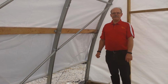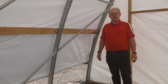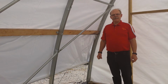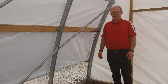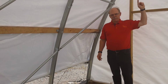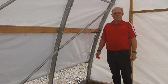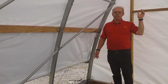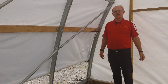Once the warm season is there consistently, then it would get rolled up, and basically you're going to have a roof for the summer. The one thing that we do suggest to complete this package is that you have a vent near the peak at both ends. That way, when you have a dead calm day where there's no air movement, but you have the opening near the peak, you're creating that chimney effect, so you're still getting air movement.